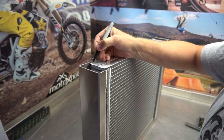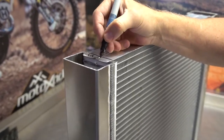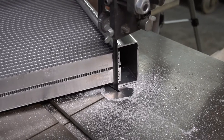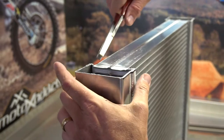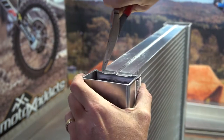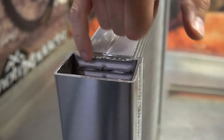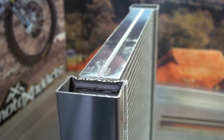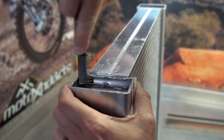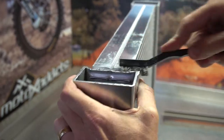After you've sliced the core off, get in here with that blade again and slice right here, then remove all of this excess tube material. There's going to be some cladding on this header piece of material, front and back. Make sure you get in there with a wire brush and clean that out really good. Use a grinding disc or a sanding disc as well. Make sure your metal is pristinely clean before welding.